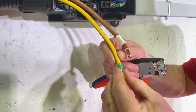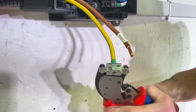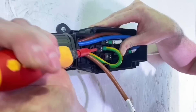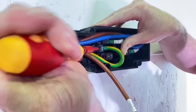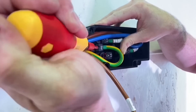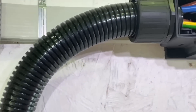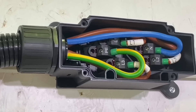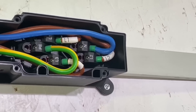This is our junction box to bring in the incoming cable. We've selected a 16mm² tri-rated multistranded cable, and we're adding a ferrule to give suitable treatment before putting the conductors into the cage clamps. We went for the largest cable size it could accommodate — testing the process. We brought it in with a 40mm flexible conduit through an M40 hole into this junction box. You can only come in from one side on this junction box.